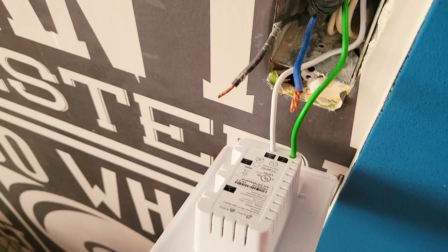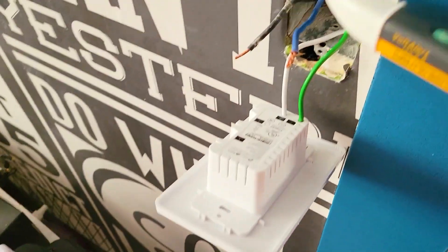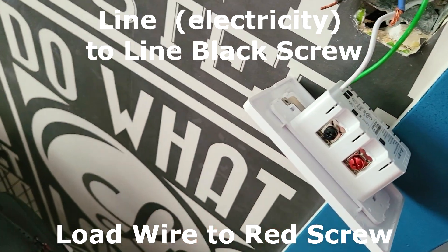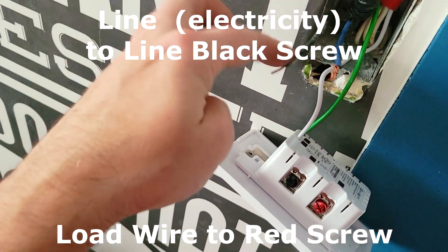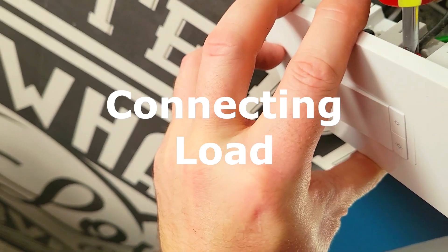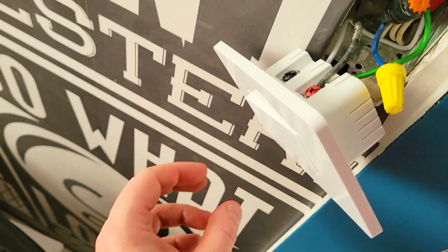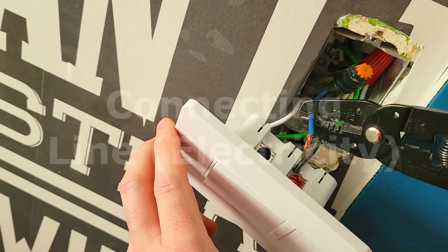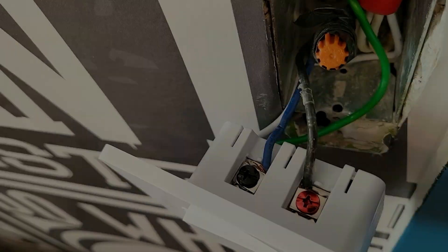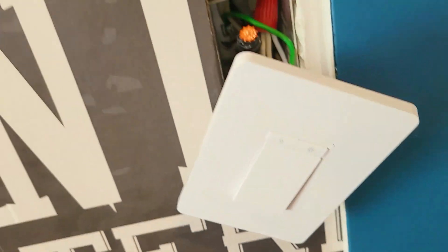We've now got two cables in, with two left — the blue, which in our case is the actual power line. The one with power coming in connects to the line, which is the black screw. The load — the second black one with nothing coming in — gets connected to the red screw. If you wanted to run an extension from here into another receptacle, you'd feed another cable in from the top since there are spots for two. Let's connect the blue wire at the very bottom, tuck the screw, and we've got light — it's working! The blue is connected, the black is connected. Quick test — you can see it's red because it's not yet configured with the Wi-Fi.